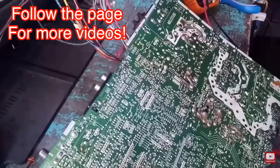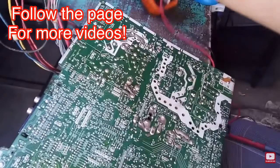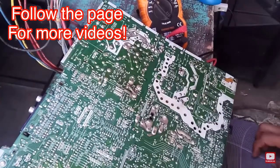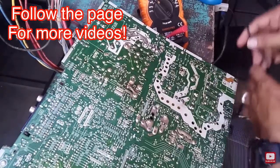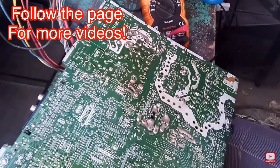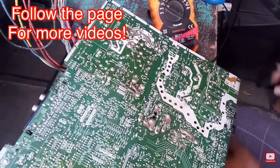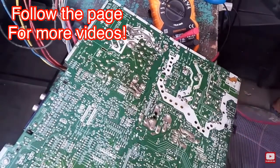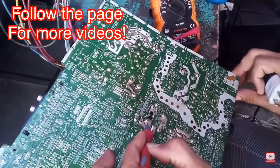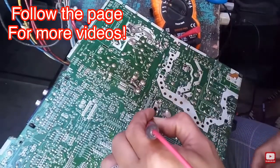So here, let me just put this resistor. Here, guys, we just put the resistor in the circuit, and we are going to check the voltage. I still have the capacitor, but it's not connected into the circuit, but it's okay because it's not in that section. You're just going to test if the B plus is normal, and then we're gonna replace the rest of the components, which are the capacitors. So we are going to plug in, and we place our test lead into the secondary capacitor.